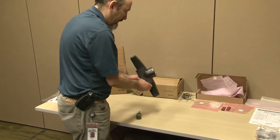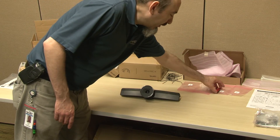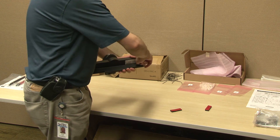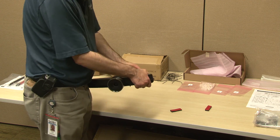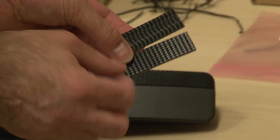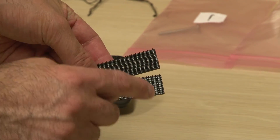If the system uses a G5 series display model, remove the camera's mounting screws, as those are only used on G4 series display models. For systems which use a G5 series display model, dual lock adhesive strips are used to mount the camera to the top of the displays. The camera's rubber bottom can be removed to allow the adhesive portion of the dual lock fastener to adhere to the camera better. Note that two types of dual lock fasteners are used together for optimal holding strength, and they ship already attached to each other. The two different types of dual lock fasteners can be seen to have different surface patterns.